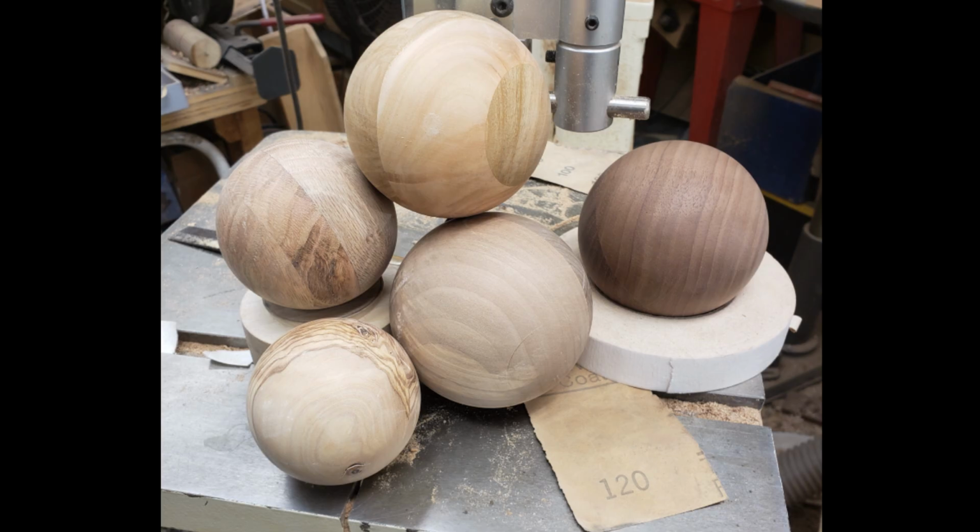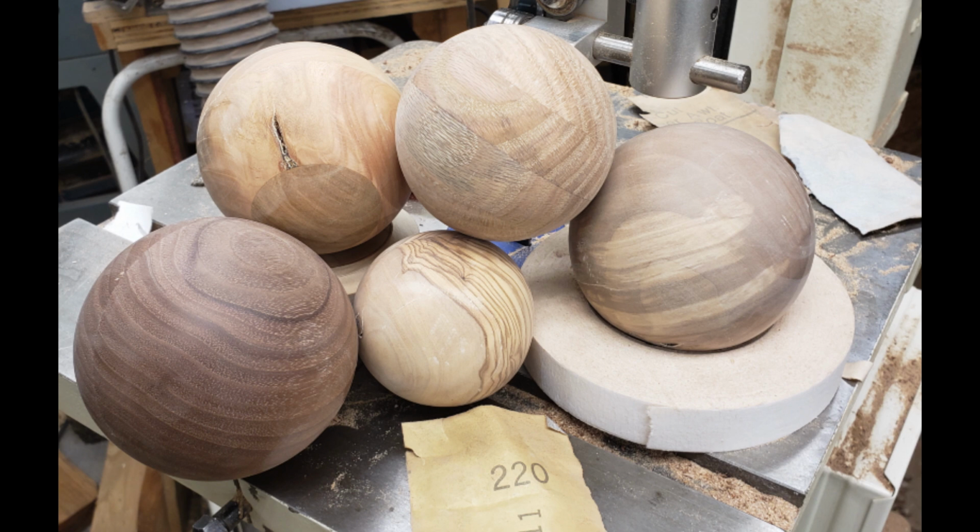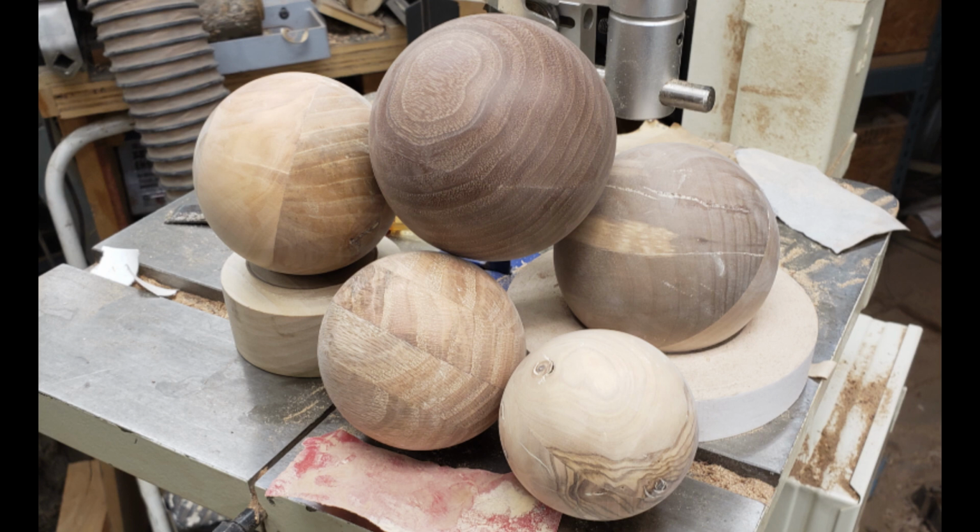The trick is to press the wood into the cup faceplate with enough pressure that it does not spin, but is not enough to crack the hollow wood. At times, it would spin, in which case I would tighten the tailstock a little more. If it left a burn ring, I would rotate it immediately at that point to sand off the burn.